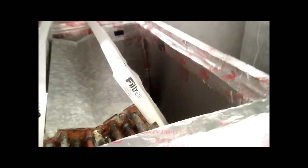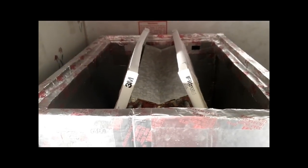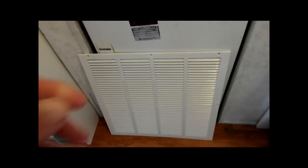It's all laid in and taped in. The front is finished up. The top is taped in and sealed all the way around. A few little touch-up spots, a few little cracks, but for the most part it's all sealed in nice and well, and we have a nice lip to put the new filter on top. So all we have to do now is come up with some new return air, because now that I've blocked off this whole section it was sucking in before. I'm going to put a return grill up here in the top section. I have a new grill purchased — it was the largest one they had — and it turns out it's absolutely perfect for the width.